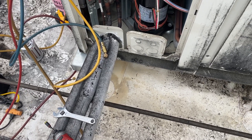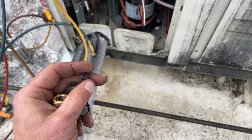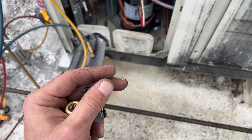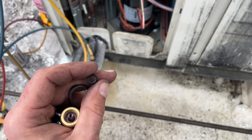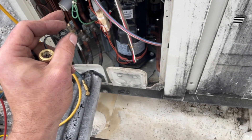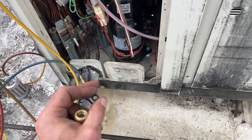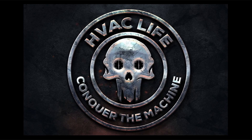That's a wrap — I'm just going to finish up making sure everything's working well. One last thing I'll mention: on your 5/16 Schrader caps, always check for these O-rings before you put them on and after you take them off — they've got a bad habit of spitting O-rings. When I went and took this cap off I heard it, found it down there. Just get in the habit of checking them.